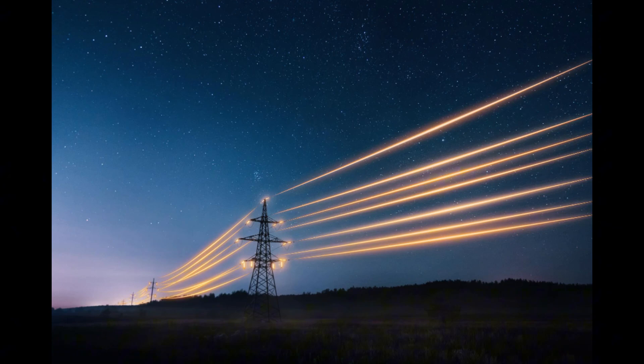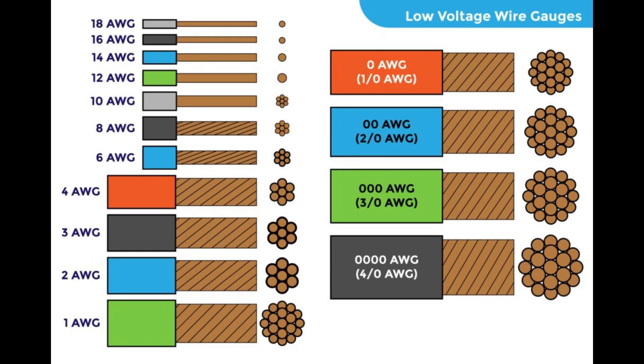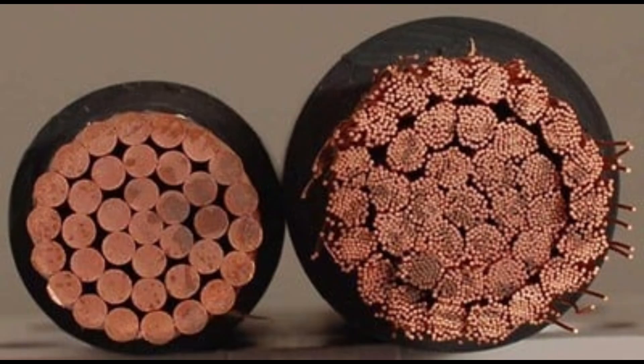Efficiency and heat reduction: because current is lower at higher voltages, there is less resistive heating in the wires. Less heat generation can mean better overall efficiency and reduced stress on your components, translating into a longer lifespan for your system and potentially more usable energy harvested from your solar panels. On the other side, we have the DaySun 12 kW, a 48-volt hybrid inverter. This model can produce up to 12 kW of power, which is quite substantial for a 48-volt system. But that high power means high current, often hitting 240 or even 250 amps. At 250 amps, the National Electrical Code wants us to multiply by 1.25, getting 312.5 amps. Single-run wires of that capacity can be massive — think 400 kcmil copper — or you may opt for parallel runs of 2/0 or 3/0 AWG. That is a lot of copper, a lot of conduit space, and it can be more expensive and more complex to install. While low voltage still appeals to many because of its wide availability of 48-volt batteries and familiarity among installers, it does mean dealing with higher current, bigger wires, and potentially more heat.